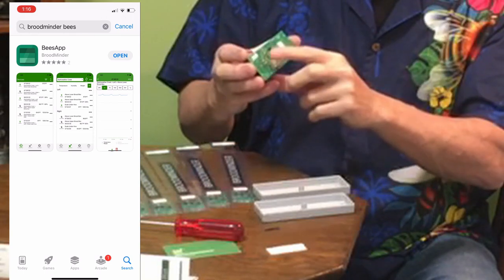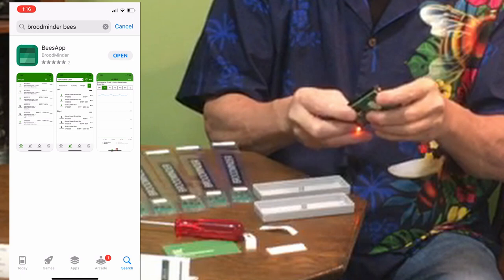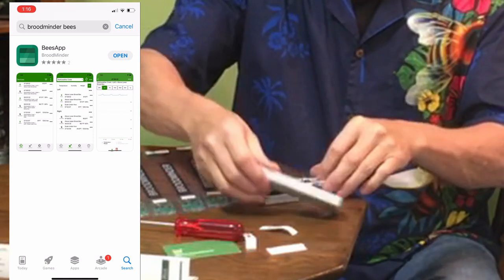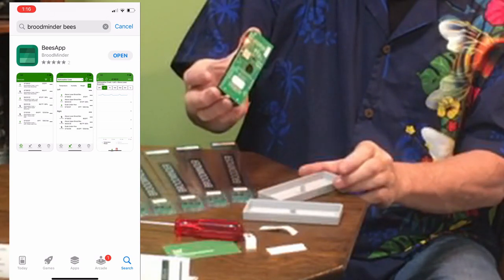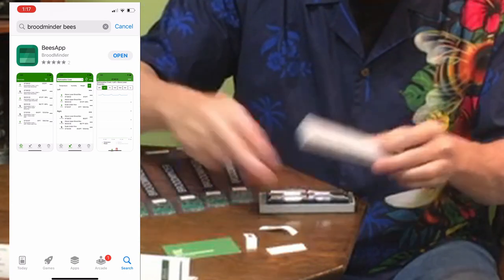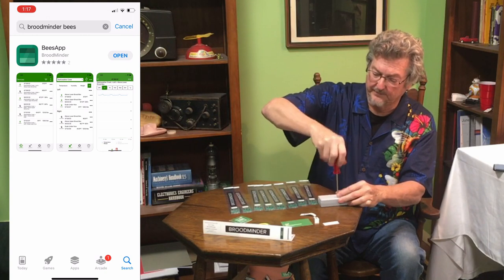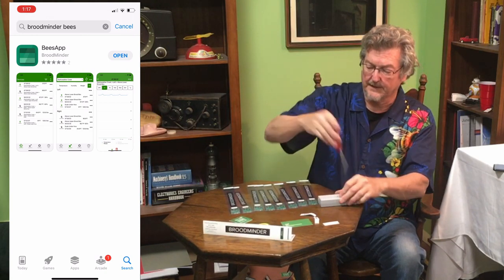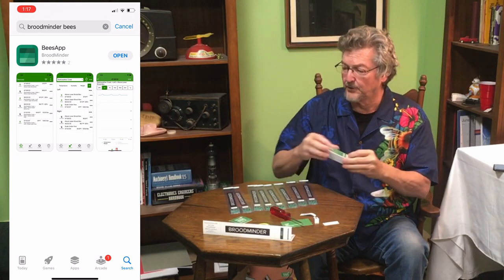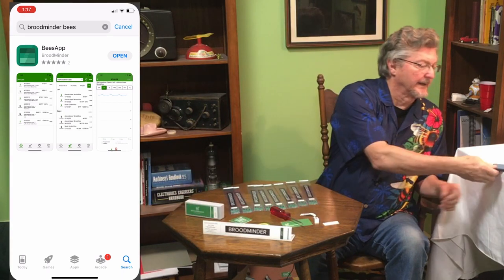To start it, take it out and look at it — it's got a temperature chip, little memory, and a microprocessor. Pull these battery tabs and just make sure the batteries are good and tight, as the holders can sometimes be a little flaky. The LED lit up and it's flashing the same way, telling you it's starting up. Find the screw hidden under there and put it back — it takes a pretty small screwdriver. I've tried sealing this with different kinds of glue but they just won't seal, so put it in a Ziploc bag or inside one of your hives undercover so the weather can't get to it.